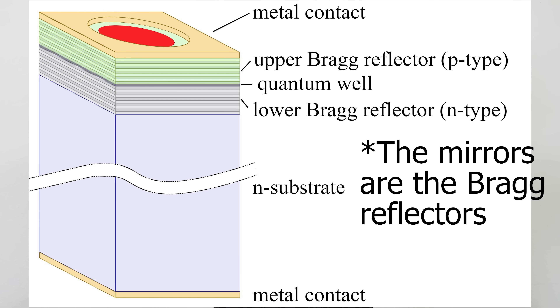In order to make a laser you have to have a source of light that you bounce back and forth across mirrors. Because photons actually prefer to be in the same state as neighboring photons, if you bounce them back and forth a lot together they'll eventually enter the same phase — so you can phase the photons together and it comes out as laser light. To get thirty thousand lasers on a tiny sensor, you use MEMS technology — the same technology used to build computer chips. You make a top layer and a bottom layer representing your mirrors that bounce the light back and forth, but you make the top mirrored surface a little bit less reflective than the bottom one, so that after a lot of bounces the light eventually escapes as the laser beam. You can have huge arrays of these and they don't use a lot of power.